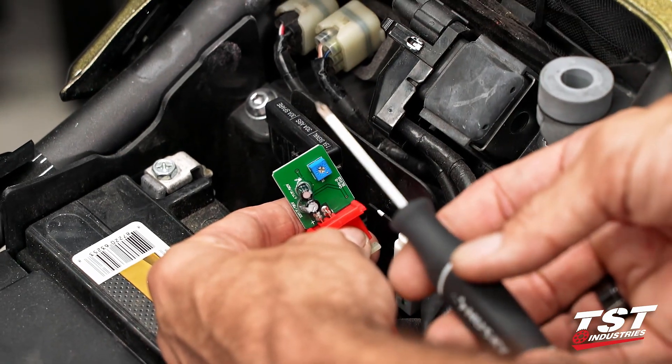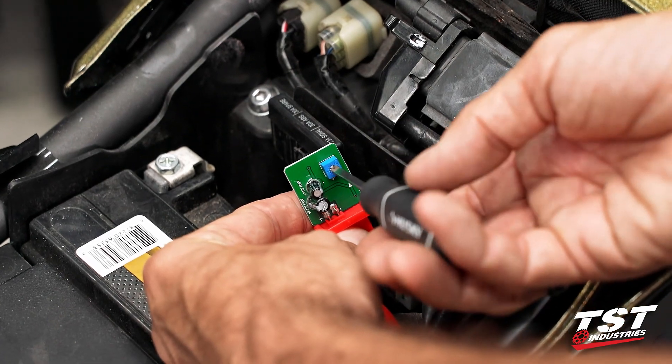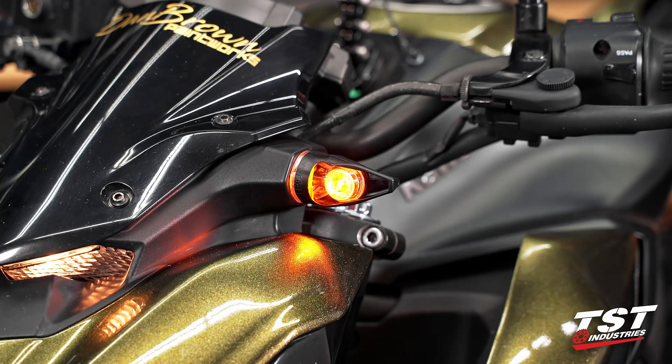With a small screwdriver, we'll go in and turn the potentiometer counterclockwise to increase the flash rate all the way to the limit, where it will go very fast. And clockwise, we slow it down until we have almost a standstill — very, very slow. So you can back out somewhere in the middle, which will be where it's probably most to your liking.